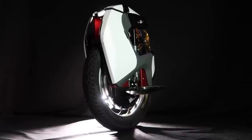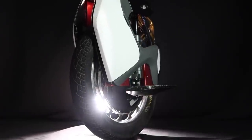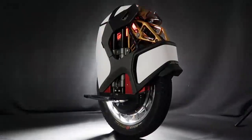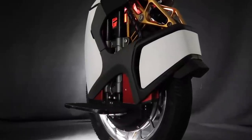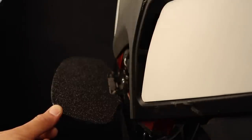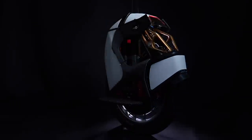It's powered by a 2200 watt motor and an 84 volt, 1100 watt-hour battery. It specs a range of about 60 miles in ideal conditions, but realistically you can expect about half of that if you're riding at the top speed of 30 miles per hour. The pedals are slightly longer and skinnier than the 16X but fairly comfortable. On the back there's a mud guard and a brake light.